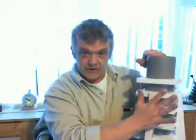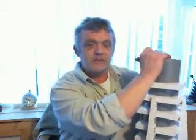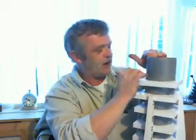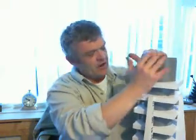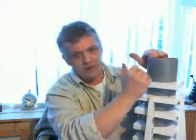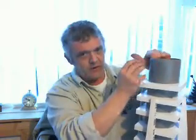In this case, of course, it's part of the structure, so the pipe really needs to be stably held in there. It's forming like a cradle. Okay, so these are really quite a good fit, and they're cut at 1/11, 1/12, something like that, and they just slide on. Again, a bit of super glue on there. Don't try to super glue it, then slide them on. Slide them on, mark where you want it, put a ring of super glue, and just slide them back up. About a minute or two, they'll be rock solid, and there'll be no moving them.